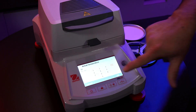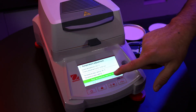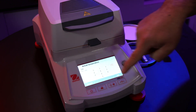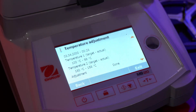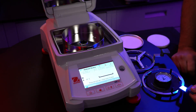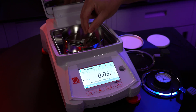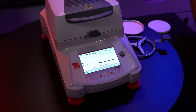Both tests will take 15 minutes to complete. Once completed, you will have an additional 15 minutes to input the temperature reading of the calibrator by looking through the vent on the top of the lid. Once both tests are done, you'll be shown the complete temperature adjustment readings. Remove the temperature calibration tool — be careful, it is hot. Place the pan support back onto the balance, place the sample pan holder back into the unit, hit exit, and now we're ready to begin testing on samples.